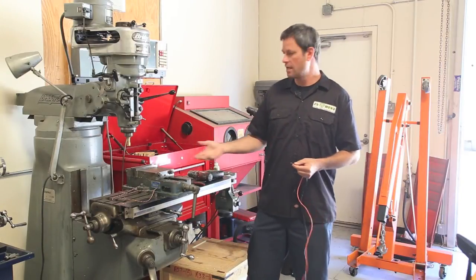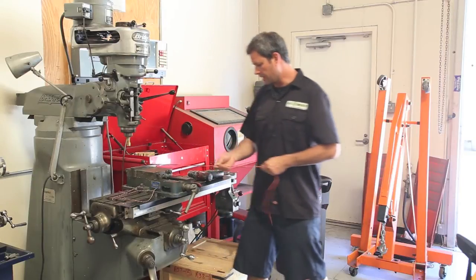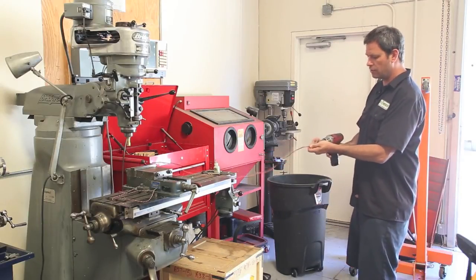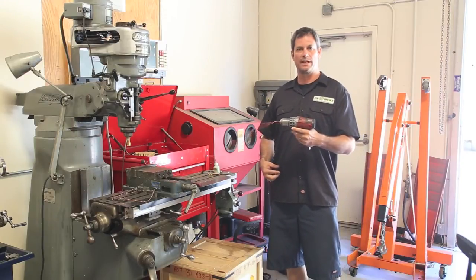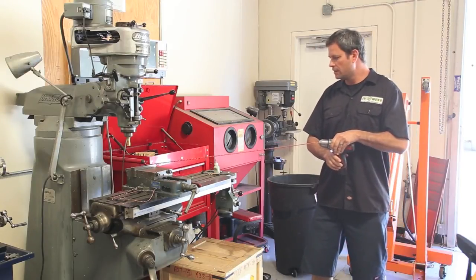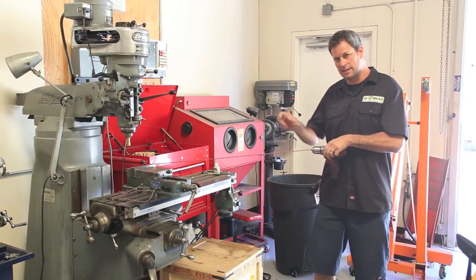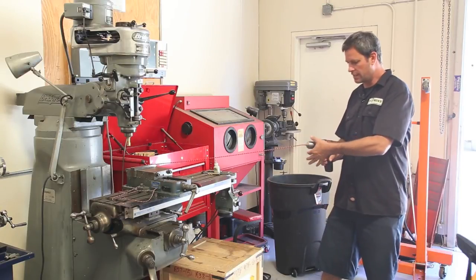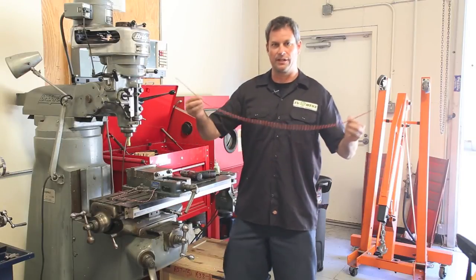Take your two pieces and put them in a vise — I'm just going to use our mill vise since it's right here. Clamp it down, stretch it out, and I'm just going to use a cordless drill. Get your two strips, put them in the chuck and tighten it down. When I go ahead and twist this, I want to put constant pressure on it — if I do it loose, it'll get all tangled up. So I'm going to pull back, put a little constant pressure on it and twist it up. Once it becomes nice and tight, I'm going to run it a little further and then back it off while maintaining pressure on the drill — that sets it so it doesn't want to unravel. And there we have our twisted pair — you're going to have a nice clean signal for your current sensor that comes off of your shunt.